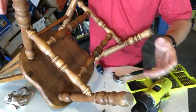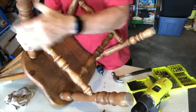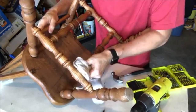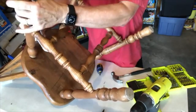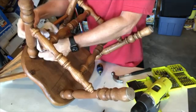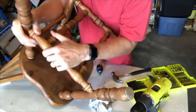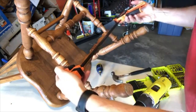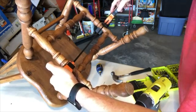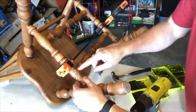All three are now lined up and we're going to squeeze them together. I'll wash my finger off and catch some of this glue that's dripping. Once we push the spindles into those little holes, we're going to have a little bit of glue squirting out. We'll pull these tight using a bar clamp to suck this joint in nice and tight.